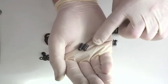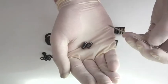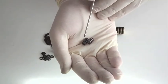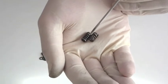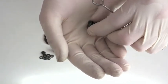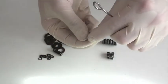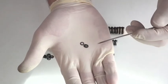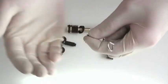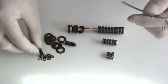When we wanted to make very small regulators, trying to make a spring that's very small of extremely thick wire gauge material can be difficult. After asking around, to make it they were going to have to make special tooling, and for the small quantity we wanted it wasn't really economically possible. We had some samples made — you can see this one is made out of square section gauge wire as opposed to round — but we couldn't get anywhere near the force required. When we switched over and had samples of the little Belleville washers, we could easily stack these up and get the force pressures required in this particular regulator. So these are quite small and you can use them to make quite a small regulator — that's one of the main benefits of the Belleville washers.